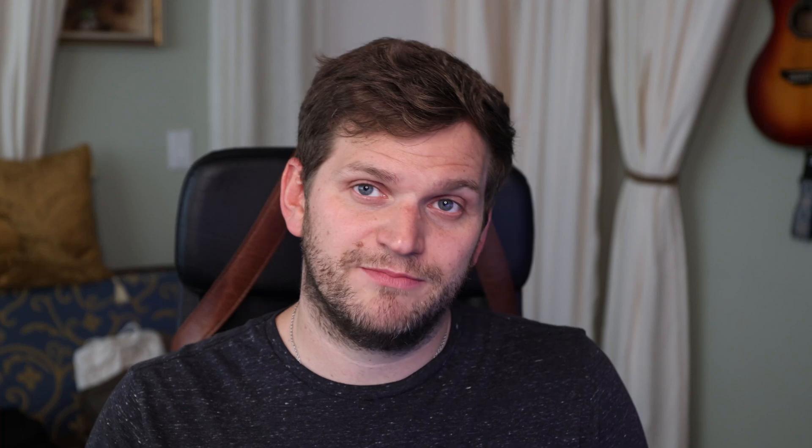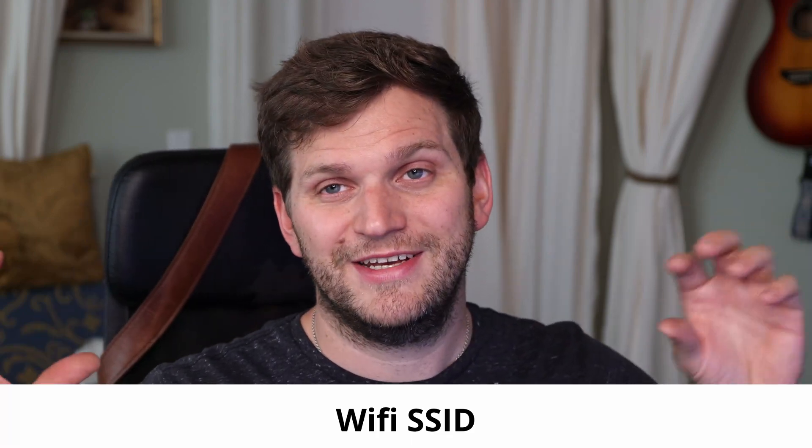It's very important — it needs a constant connection to the Victron VRM portal. Which means, how do I solve the problem of having constant Wi-Fi, and when I say Wi-Fi, not just a local network — internet. I have one of those little hotspots with a SIM card, and the trick is I set up the Wi-Fi name exactly like it is here at home. I'm using this hotspot with the same Wi-Fi SSID, and as soon as I leave home and have this hotspot on, the Raspberry connects back — without reboot usually — to the Wi-Fi hotspot, meaning I have a constant internet connection in real time pushing all the information up to the VRM portal.